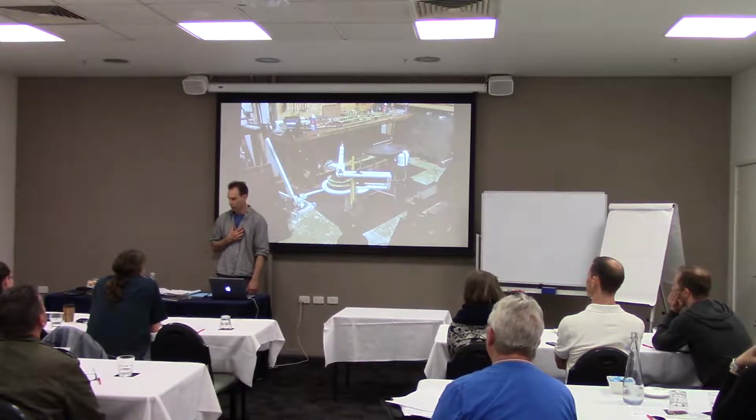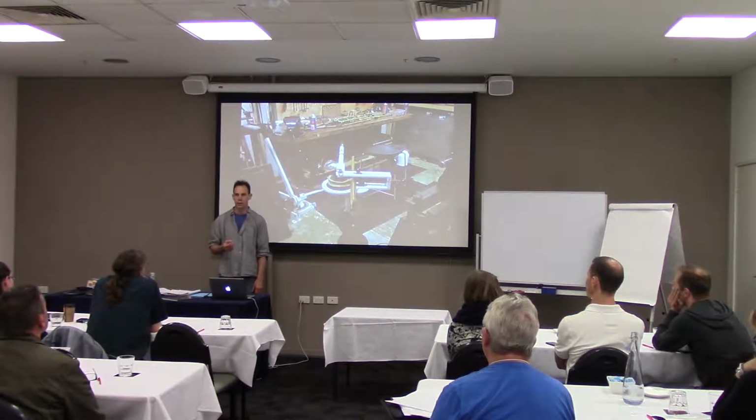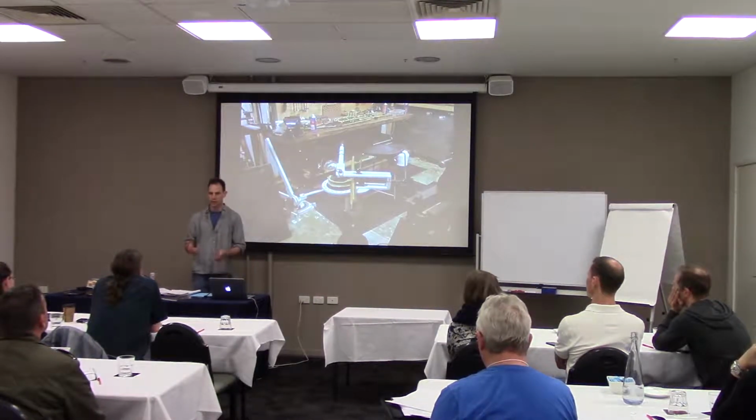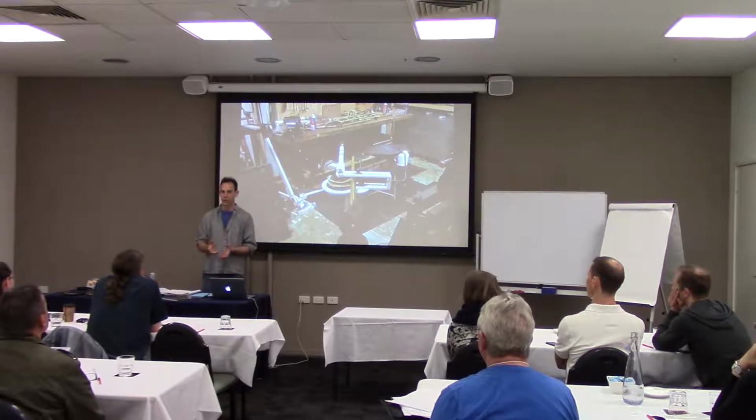Pitch-wise, there's about 3 different kinds of pitch you're going to run into. There's red pitch, which is great for repoussé and chasing in metal, so you're working it from the back and the front. Then artists will use that. It's not good for bending. Don't use red pitch. There's also a jeweler's pitch, which is a little separate. It's kind of a gray color.